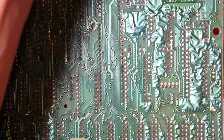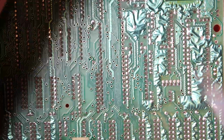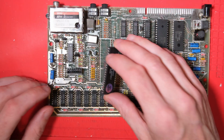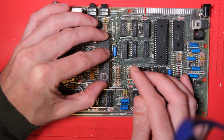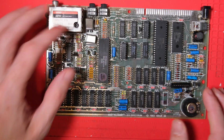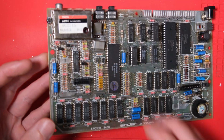Okay, I want to run the ULA with a heatsink, and I want to run this inside a rubber key case, which means I need to take the socket out for the ULA and solder the new one directly to the board. If you're eagle-eyed, you might realise that this is a different ULA to the one I tested earlier. Found a few tested old stock on eBay, lucky me. So I'm going to pop one of these in, put it to work.